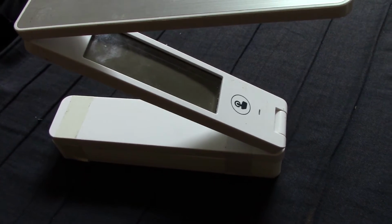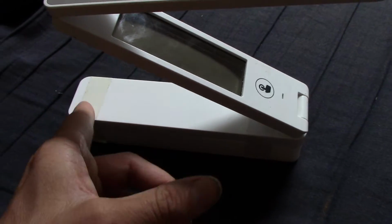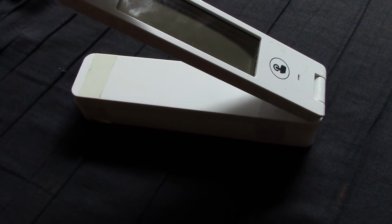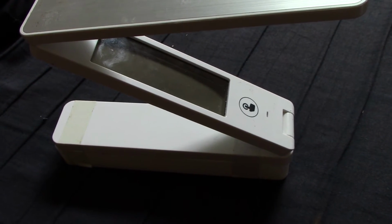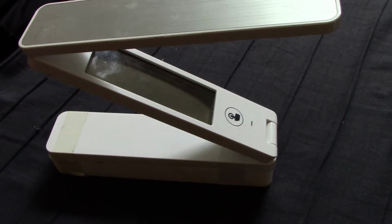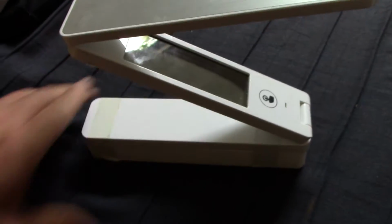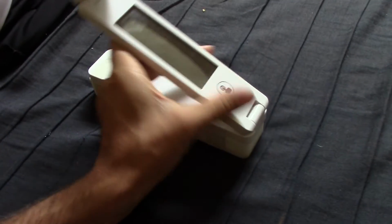I also had to put a diode in series with the step-up converter and the main board so that the battery voltage doesn't feed into the main board and then into the output of the step-up converter. So it requires 2 diodes, 1 resistor, and that N-channel FET, as I mentioned before. Those were the extra parts needed. Works pretty well. The downside, of course, is you get the loss with the voltage drop across the diode. If I really cared, I could use some fancy Schottky diodes, but I don't care because this thing has 8 times the power. This thing is going to last a really long time on batteries, which is why I did this. And it's now going to be my number 1 LED portable light. This thing rules. It's really good. I wouldn't have done all this work if it wasn't a really great light.